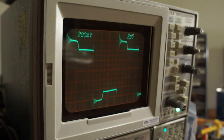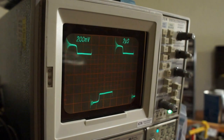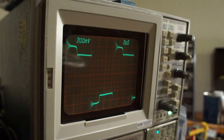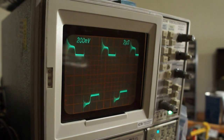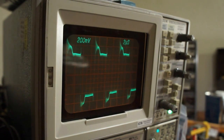So here we are looking at this waveform, and this is on the output of the H-bridge into the primary of the SSTC. As we sweep the frequency on this, you'll note various notches coming in and out. I've never really seen anything like this before.